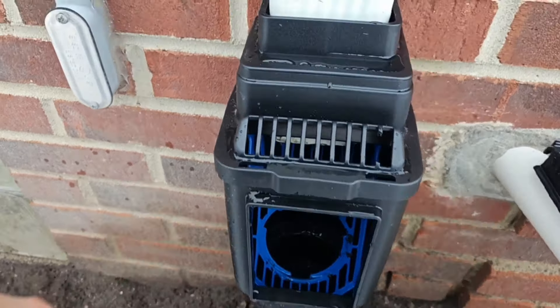All these parts, when we designed them, we made them with this type of thing in mind. That's why the system was already set up to run heat tape through it, run a camera through it for an inspection, and have a garden hose go down through the center portion to flush any shingle gravel stuck in the elbow out to the inline sediment trap. This is definitely an easy, fun DIY project — super clean, super easy. If you have any questions or want me to make a video, leave it in the comments. I'm your host Robert Sherwood, and until the next video.